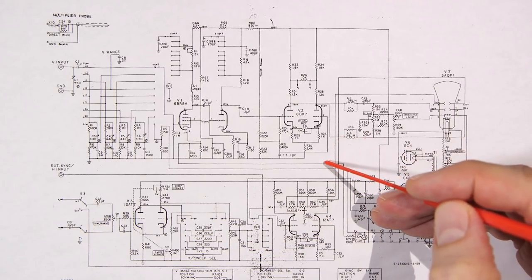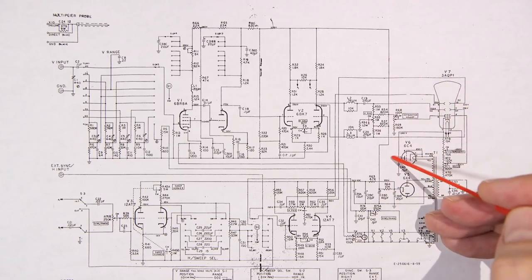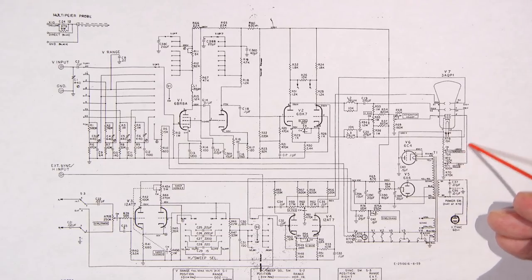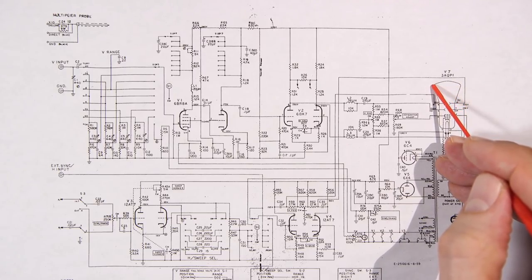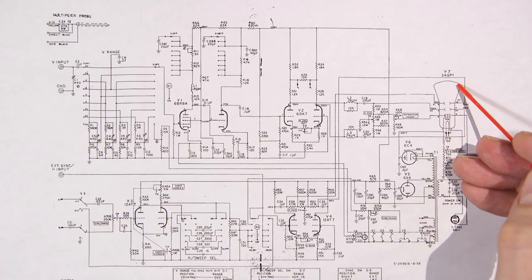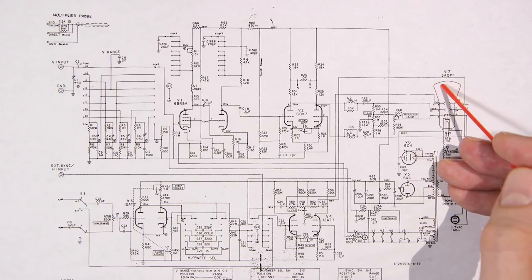So if you were to look at this on another oscilloscope, you're going to see this action and then it drops and then this action again. As it's doing this, the voltage is climbing to a peak. It's getting to a peak. It's dropping back down to the point here again. Say this is at the baseline. It's dropping back down to the baseline. It starts to ramp again, drops back down to the baseline. So as the voltage is climbing, it's driving that dot across the screen horizontally. And then as it gets to the top, it's at one extreme end of the vacuum tube. And then when it drops, it goes back to the other side again. And then it starts over again. And we're getting this effect going across the tube. So from this side, and then bang, back to this side really fast, to this side again.